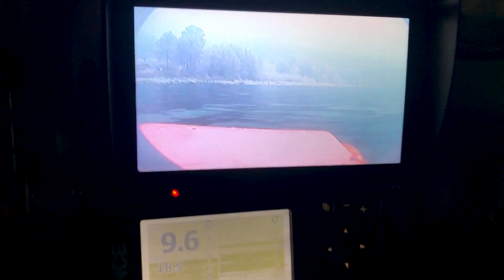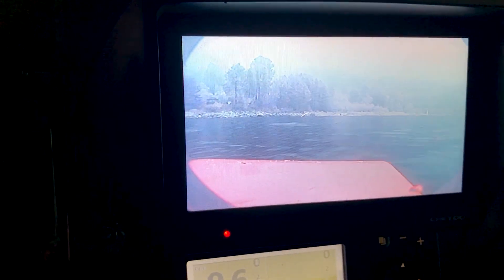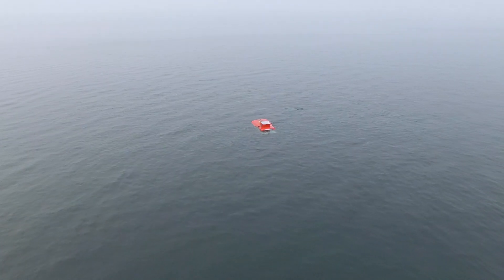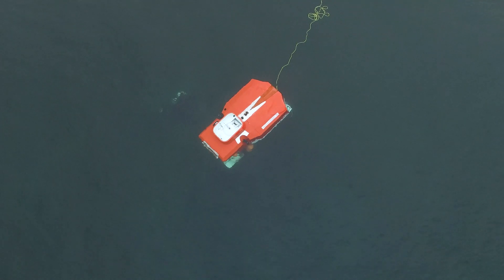I'm on Cooney Lake right now and that's my forward camera telling me when I'm submerging. Right now I'm diving the back down, and you can see the water line in relation to the deck of the sub. I like to dive with the back down a bit to make sure the tanks are venting. The water is just coming over the deck now, starting to go down. It takes a while to vent all that air out — and we're under.